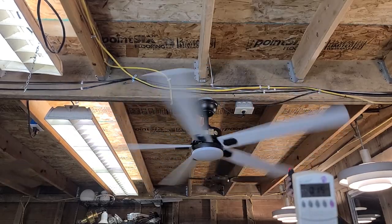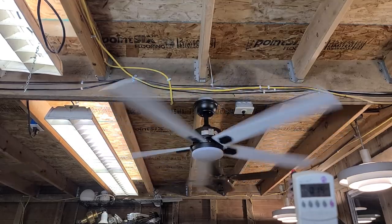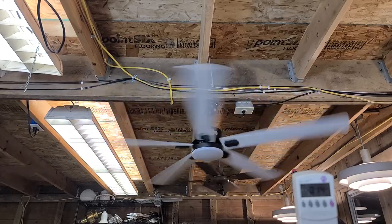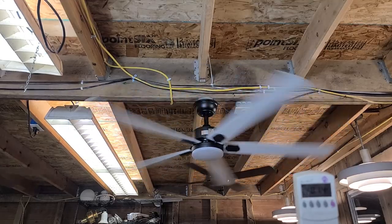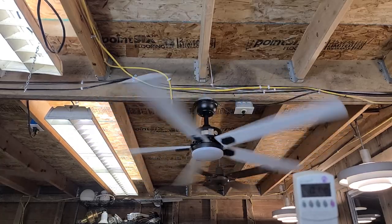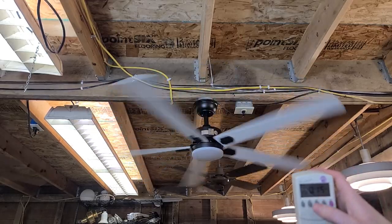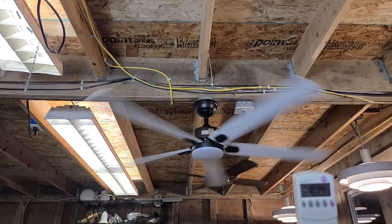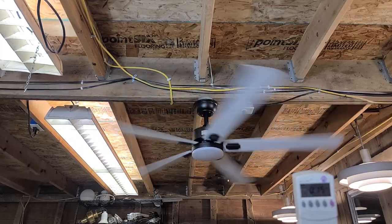We commented in the last video, you weren't here yet, Pete, that these 6-speed DC fans are kind of like IntelliTouch. Which was effectively a modernized variable speed because there's such little differences between the speeds. What are you getting? 555. Okay. 111, right? Yep. I don't even know why I bothered doing the math. Even I could do that one. What are you getting? 111. Oh. So it's climbing. All right, so 0.15 amps, 10.4 watts, and half a power factor. All right, so this is going to be speed 4 now? So this is getting up there.